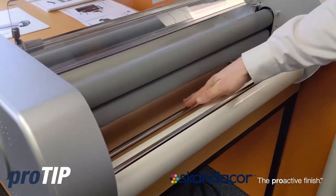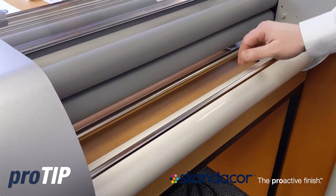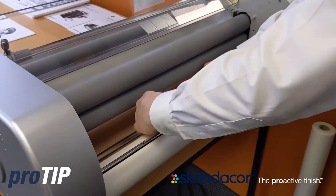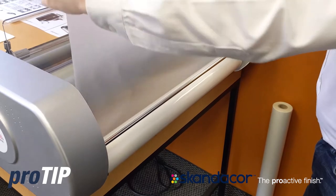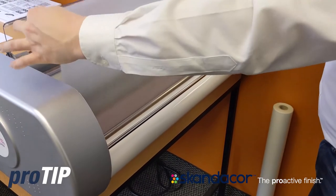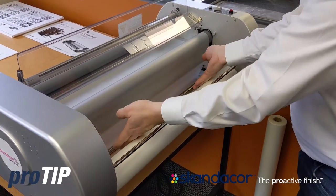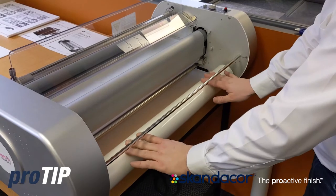On this particular model it's got a drop-away idler bar. As you can see, this idler bar goes and locks up in that upper position. Some models that lower idler bar is in the fixed position. This particular model, to allow it to load easier, it's got a candy cane slot that allows this to drop away for ease of loading. Now I take my loose tail of lamination film, pull about 16 inches out, and I want to thread this underneath that bar. I take the film, pull it taut left and right, and I'm going to go ahead and drape it right over that top roller. I give just a little bit more slack on that film and I can now push this up into position. You want that idler mandrel locked in that position. Now I'm going to take the slack back up again just ever so slightly.